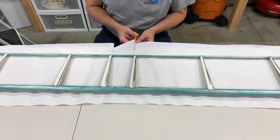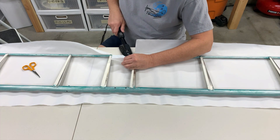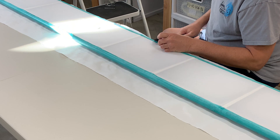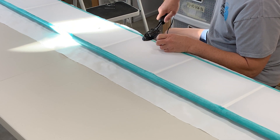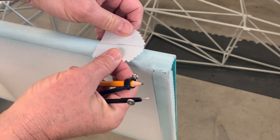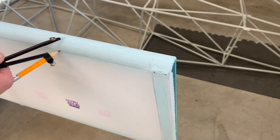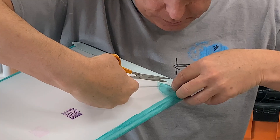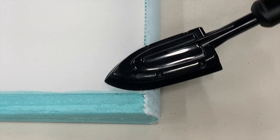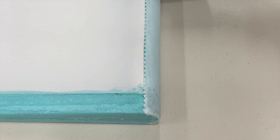While the glue was still a little sticky, the fabric was carefully cut to shape while a hobby iron was used to tack down the edges around the structure. After the entire side is tacked in place, glue was brushed on, soaking through the fabric, adhering to the glue underneath. The process is repeated with the fabric on the other side of the flap. But before applying glue over the second side edge, I used the iron to tighten the fabric over the ribs, then measured and marked a line to where I needed to only apply the glue under where the edge tape will be applied. Applying the edge tape was rather intricate, as it involved many precise cuts and sometimes stretching the fabric for transitions around the corners. The iron was used during this process to tack down and smooth out the fabric, thus preventing any fraying or lifting the fabric tape edges, which would definitely be seen in the finished product.